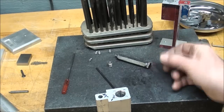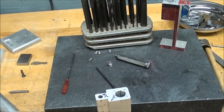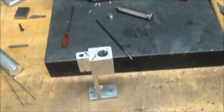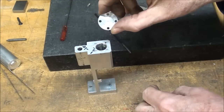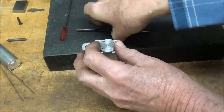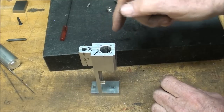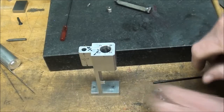There are many ways to locate these holes — choose your weapon. Another way is using transfer punches — I think everybody's got a set. You lay your pre-drilled head on your work. It's much better if you have that little pilot that holds it in position. Using the appropriate size transfer punch, punch the mark, and then stop and drill and tap that one hole, put one screw in it, and then go do the other three so it doesn't move on you.